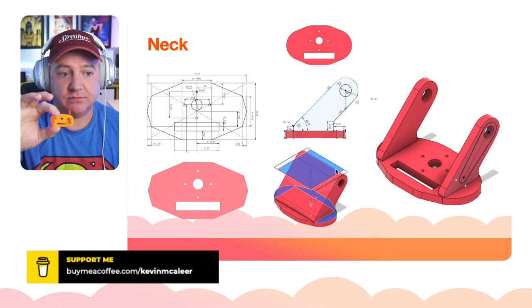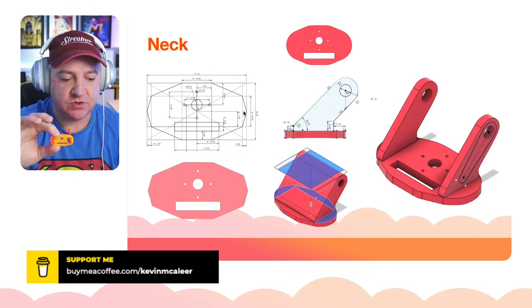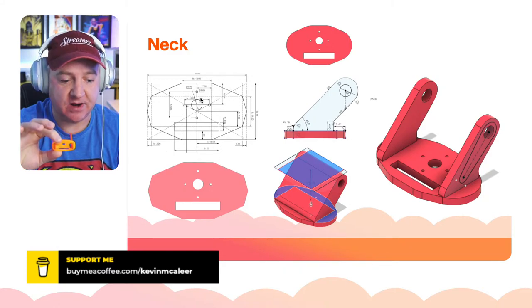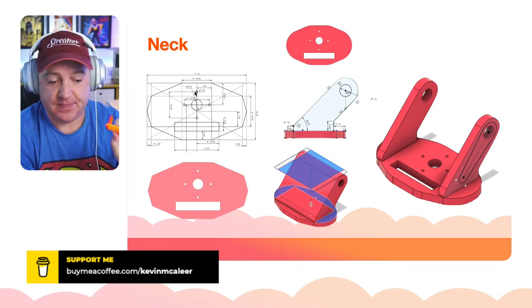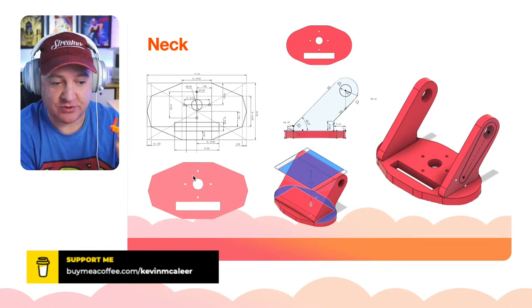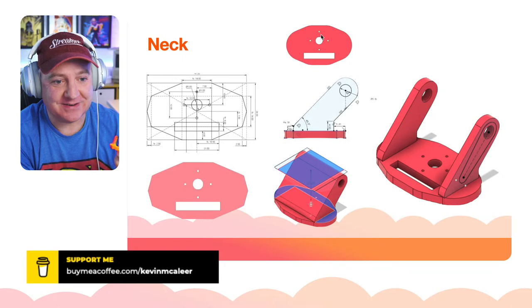And this one is an octagon. So that's what I've designed there. And I designed one half of it and then just mirrored the rest. In fact, you could design just one quarter of it and just rotate that round if you wanted to. After creating that sketch and extruding it, which is this version here, you can see all those angular lines. I then just applied some fillets and that created this very smooth looking neck piece. And I didn't use the hole command to do these holes here, which I could have done. I just used a couple of circles and extruded them through.